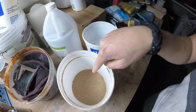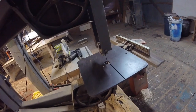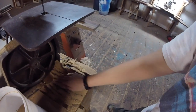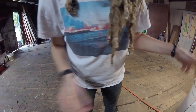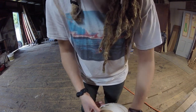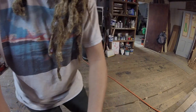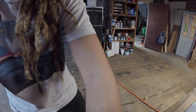Another thing we do with our wood scraps — I've got this bucket, and this has very fine wood dust. A lot of our tools, such as our bandsaw, make very, very fine wood dust. We save that dust and we use it when we mix epoxy. This makes good coloring to make the grain or whatever look the same color as the wood.